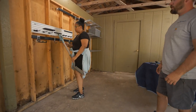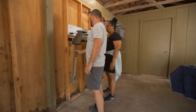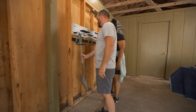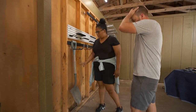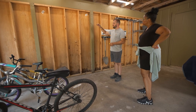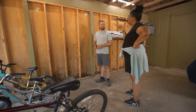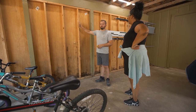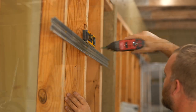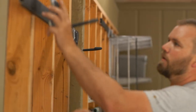So do I put my shovel on the hook? If it's tall enough you can do something like that — or you can go with this hook and put your hand on it. We measured the larger bike and it was 66 inches. I'm going to add two inches to bring it off the ground a little bit, so I'll do 68 inches here. Do you want it lower for the next one or keep them all at 68? I'll keep them all at 68 — as they grow and their bikes are larger, I don't have to worry about moving it. We're going to hit three studs with our track and put the hooks right on a stud.